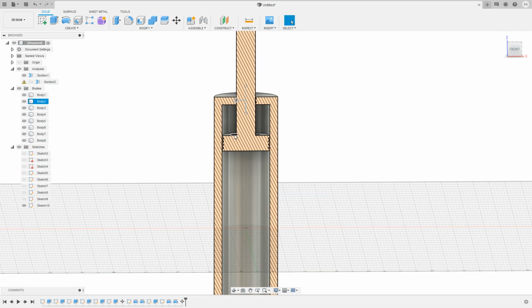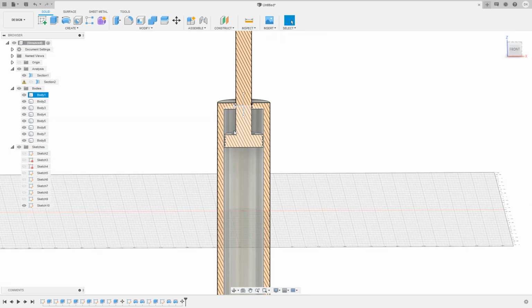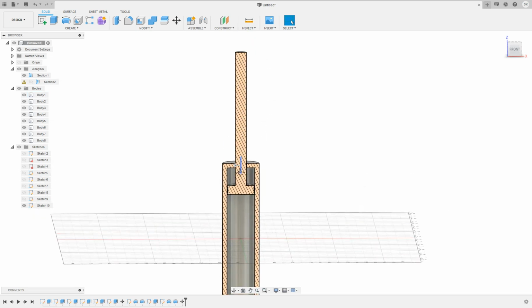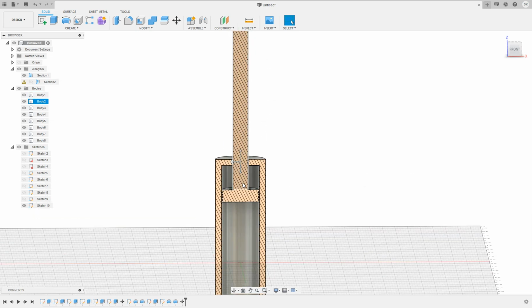But it doesn't have these fluid holes. These fluid holes only allow it to move between these 2 chambers. In a hydraulic, you wouldn't want that. You would just want an inlet here and an outlet here, or vice versa. That way you can fill this chamber and move the ram more controlled. In this case, this isn't controlled at all. It's just used as a dampener.